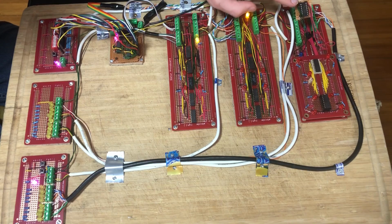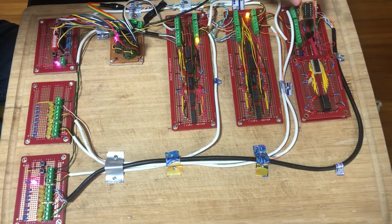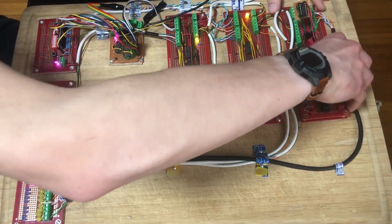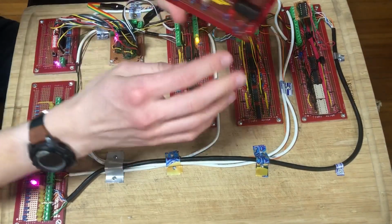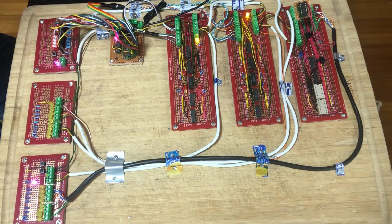This chip fried itself, and this is a new one, which is why I made a daughter board, because I soldered it in and then I couldn't desolder it. So I just had to rip it out and then solder this extra board. This right here is actually removable. And the D flip-flop chips, these two, would normally just go there. And you can put them in there, it won't really make any difference.